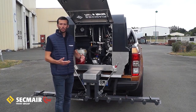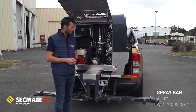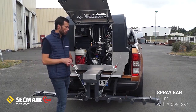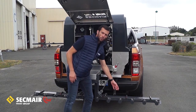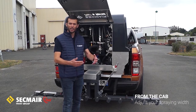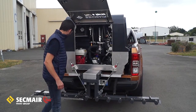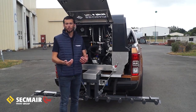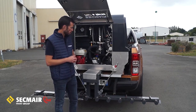Let's talk about the last really important part of the machine, which is the spray bar. The spray bar provides a spraying width of 2.4 meters and is composed of two sections, each of 1.2 meters. We have fitted it with air actuated nozzles, giving the operator the possibility to adjust the spraying width directly from the cab while spraying. All jets are controlled two by two, except the two extremes on the right and left hand sides, which allows precise adjustment of the extreme sides of the spray, and can also be used as a single jet for joint spraying operations.